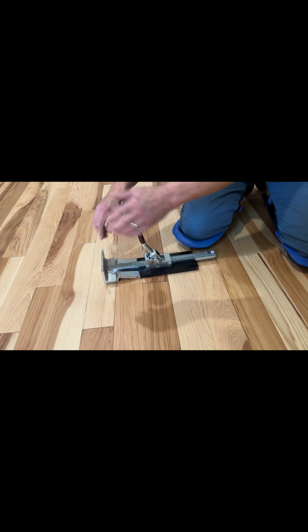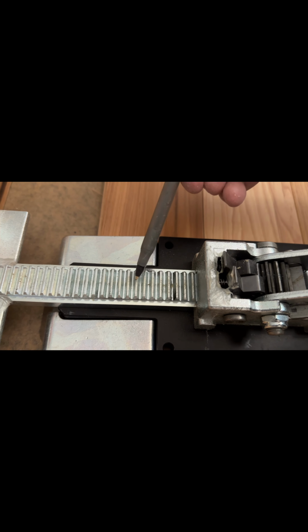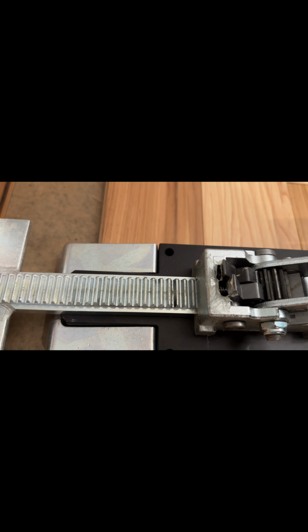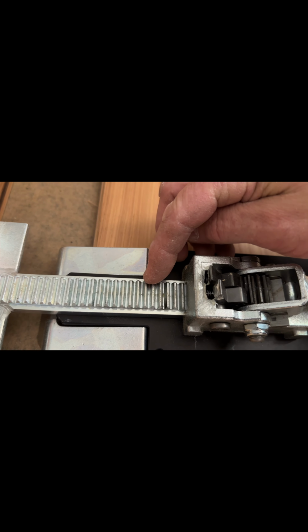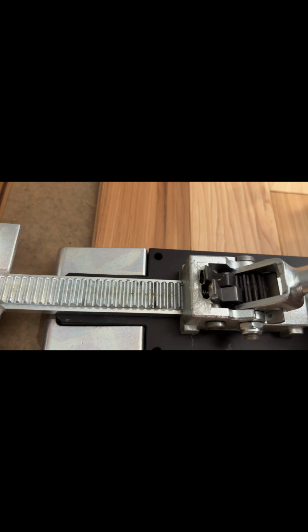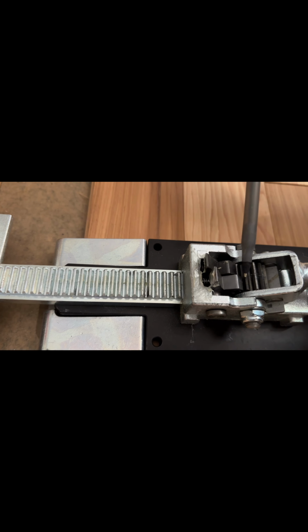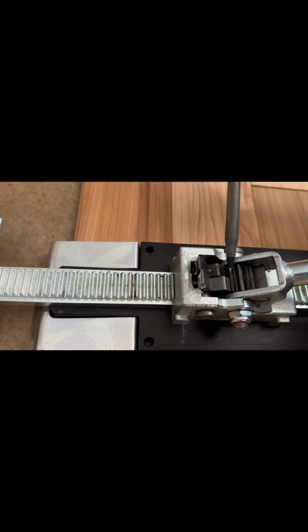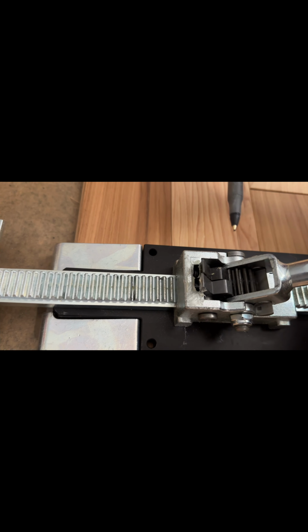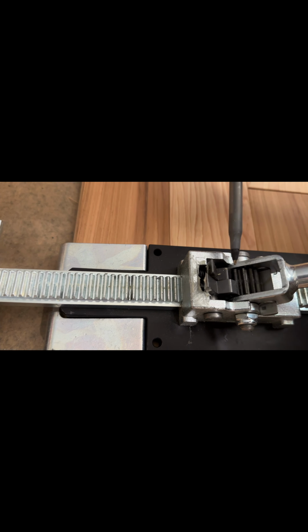So these gears right here, you might think, okay, so that might be a 1/4 inch from this one to this one. That's as close you can get it when you're fine tuning, like say there's just a small gap and it needs to move just a little bit. Well, that 1/4 inch is going to be too big, so you're not going to be able to get a full crank and make it stick all by itself if they don't have tension on it. Well, what these little bitty gears right here do, these 2 levers, it will actually have 2 stopping points in between each lever. So that gives you the fine tuning of getting super close and super minute little pushes and the locking power. So right there is good.